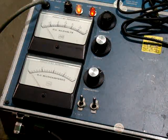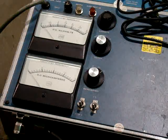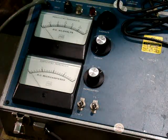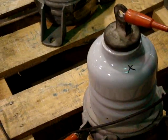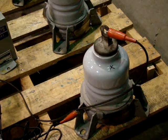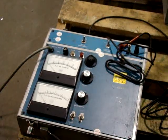I'm going to use this same tester for the lightning arrestors. On a lightning arrestor I can do the same test. I'll disconnect the capacitor lead and connect one lead to the base of the lightning arrestor and one lead to the top. Some of these are gap resistors, some have different materials, and some have oil — this one has oil.